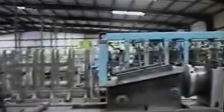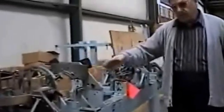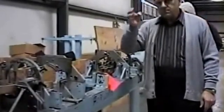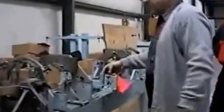Now, this is not set up for anything right now, but here's a center located for the carry-through spar. Here's a drill fixture for the carry-through spar, for all carry-through spars, except I took off the A1. No, I covered them up. The A1 is here, the attached wing lock holes. The A5 is here. So the tool starts off with all the tooling holes. You locate the spar. Gee, I forgot how to locate the spar, but I'll figure it out. Anyway, you drill the tooling holes.